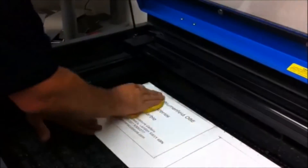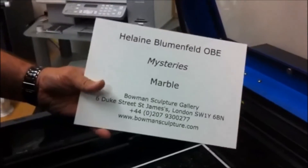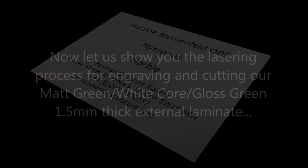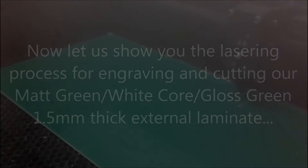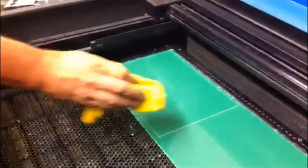That is how to engrave onto a white/black/white 3 mil external laminate. Now let us show you the lasering process for engraving and cutting our green/white/green 1.5 mil thick external laminate. We would cut out using the same settings mentioned before with the protective coating in place, then peel the coating off before engraving and wipe over the surface using a small amount of furniture polish as mentioned before.